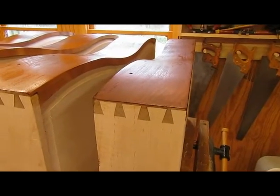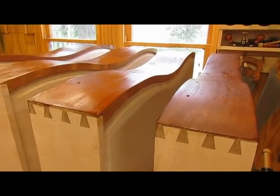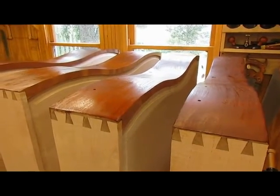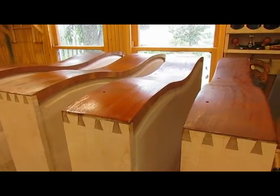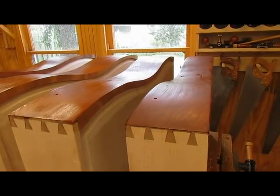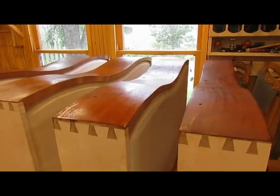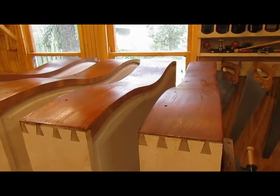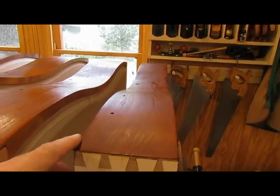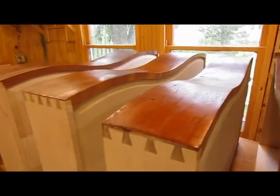I've started to apply the Water Lux to the chest. This is after two coats — the first coat just goes right into the wood and you see very little accumulate. This is the second coat and most of it has already soaked into the wood. The secret to applying Water Lux is applying thin coats. You don't want to put a lot of material on at a time. One problem with putting on too much is that it tends to pool on the edges and then it gets thicker and thicker as it builds up.